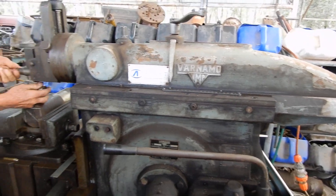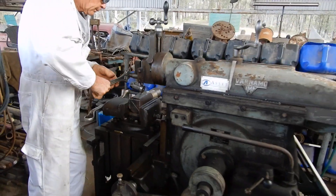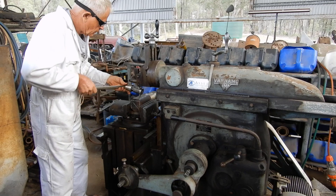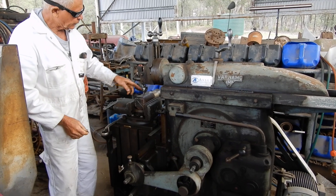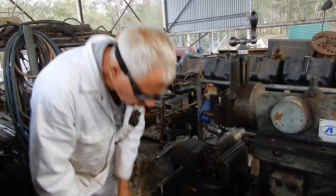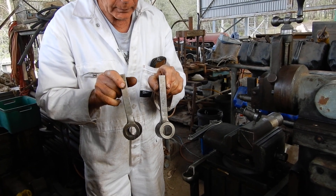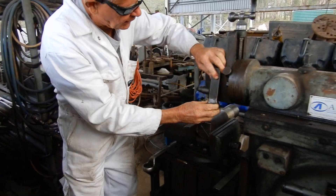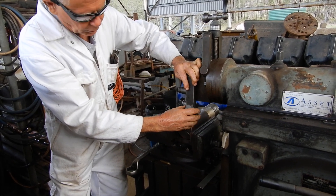I know what you're thinking — what happens if you want to cut on the side here? How do you get your positive rake then? Well, I've actually made two: a left and a right hand one, which has got the 14 degrees on that way. So when you put that on the side there, you get your positive rake out here.